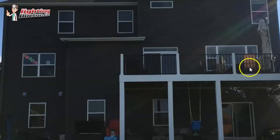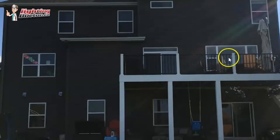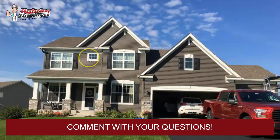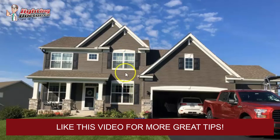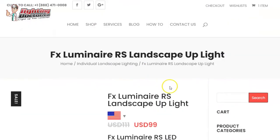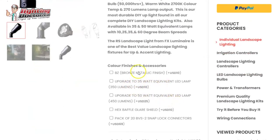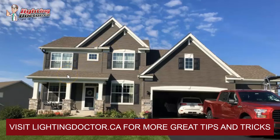The other thing I did want to mention is kind of highlighting these second tiers here. So I talked about lighting the pillars, but I would also have one of those up lights underneath the window, shining fairly upright because I want to throw light up here. I would probably upgrade the lamp from a standard 4 watt LED — which is what comes in it — to a 5 watt, which we call a 35 watt equivalent. The reason is I want to be able to shoot that light up to the second story.